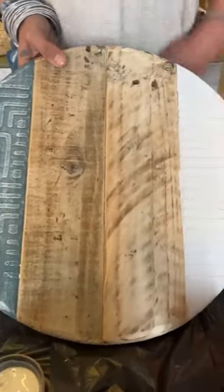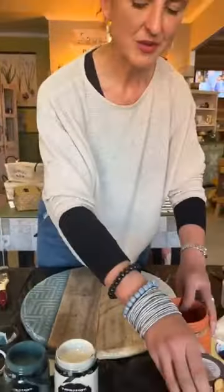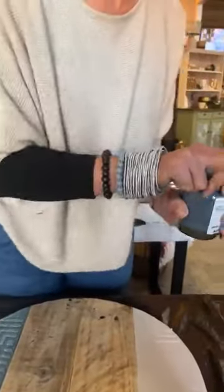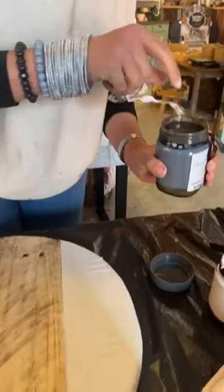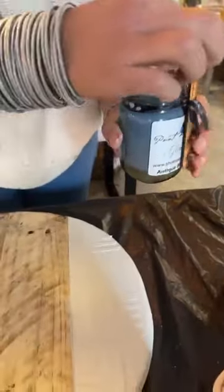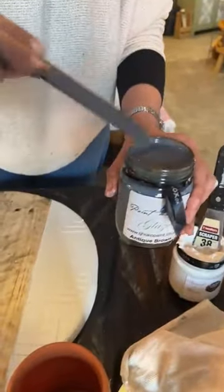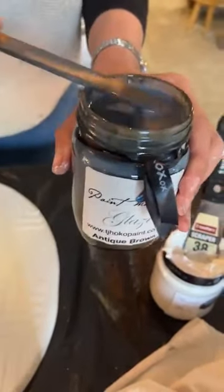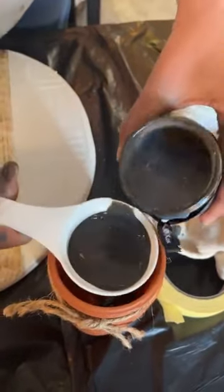Then on this side where I've painted in David, I'm going to do a wet distress. Okay, so it works like the following. I'm going to work with our antique brown glaze, and I'm actually going to use that. I use the mixing stick and I just stir it well. And then what I'm going to do is, oh, you make a mess like me.